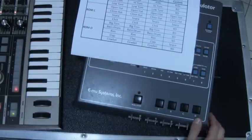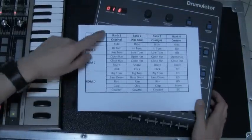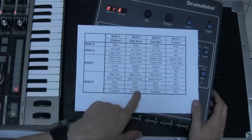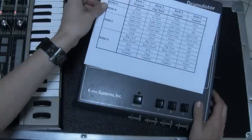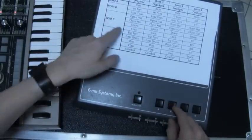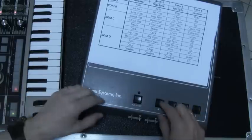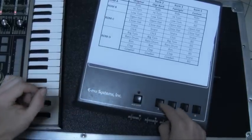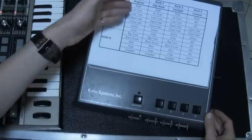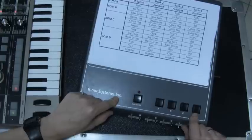The main benefit of this system is that you can switch each ROM independently. For instance, I can use the snare from bank one, ROM C, first location, and use the bass drum from bank two at the same time. So that's the snare from the original bank C in its default location. Now I'm switching bank D to location number one. That's the big benefit — I'm not just switching entire banks, I'm switching individual EPROMs per bank. If I want to switch to bank two completely, I put all switches to position number two.